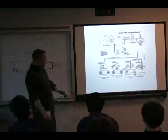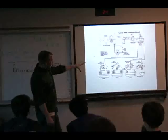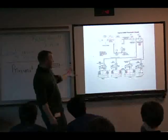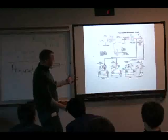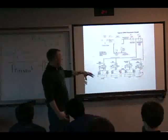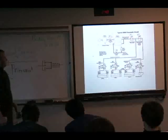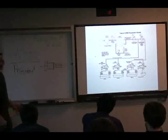And this was pulled out of the pneumatics manual as well. They did a really good job here of having a pictorial view of the system, and then on the very next page they've got the schematic view of that system laid out in the same manner. So you can go through, look at it, and say, okay, I see this symbol here, that's the compressor, and these are the air tanks. And this is really important to document your system, to know what you're trying to do.